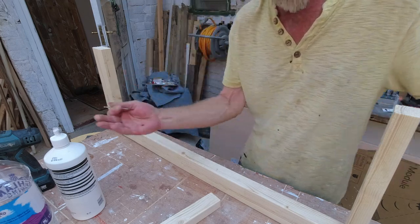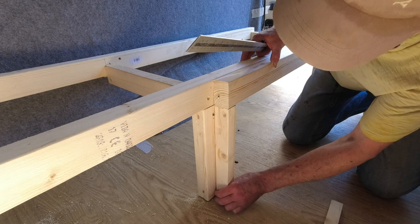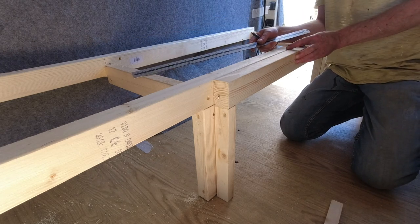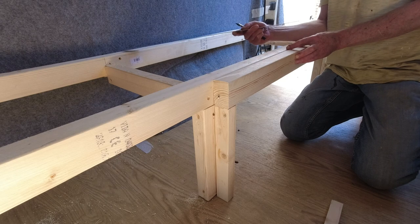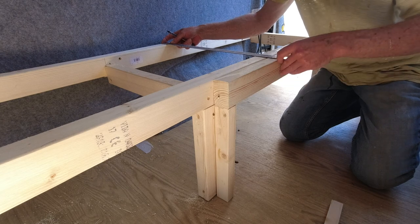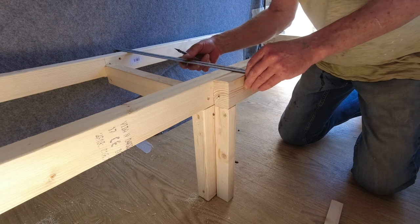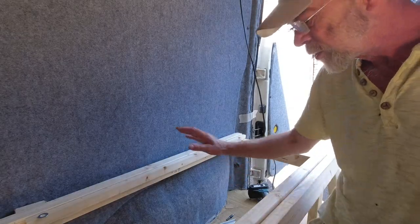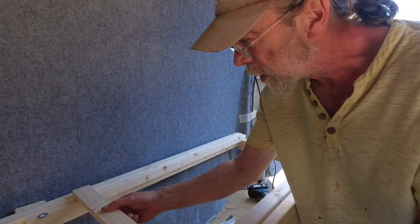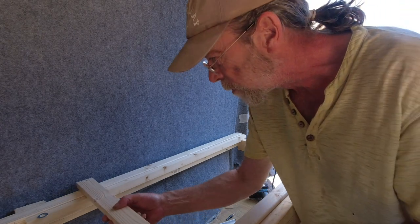Okay, so I've got this first one - that's hitting the center mark there, which is good. We can now start measuring for the slats. The question is whether to put the slats right over to the wall. I'll put the fixed ones right up to the wall and the moving ones just up to there - so that's 500. We were correct on my initial measurements. I've got these first slats cut, and I've put a round on the corner of them so when they hit back up they're not hitting flat on flat wood, which could make it difficult to slide back in. That will slide on quite nicely.